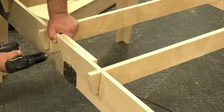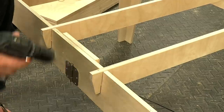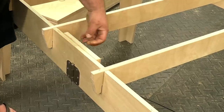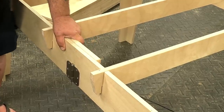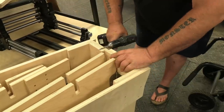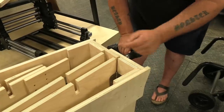To make the knob positions I'm going to drill first through both pieces with a 3/16 drill bit. I'm going to do the same thing on the other side, then close the whole thing, drill through with a quarter-inch on this side, and put some quarter-twenty threads in here. So I can just take a knob, tighten it down, and that'll lock this in the open position. Now it's in its closed position and I want to be able to lock it in its closed position too, so again I'm going to go center mass, drill a 3/16 hole through, then tap everything out and drill a quarter-inch hole so the knobs will fit.